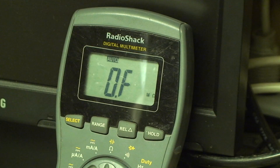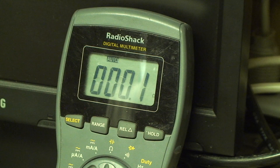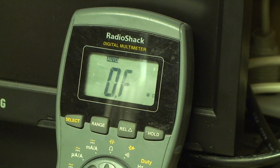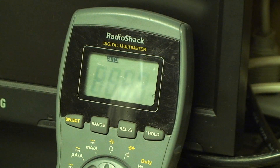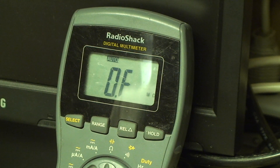There you can see the display of my multimeter. I'm going to stick the test leads on the diode, and in just a moment you'll see the multimeter update to show essentially zero ohms resistance — a very tiny bit of resistance. Now if I flip the diode around, it should gain a very high, if not infinite, resistance. But as you'll soon see, it does not do so. This diode is dead shorted. So basically any power supply attached to the router was being forced into a short circuit and either shut down by its overcurrent protection or hopefully blowing a fuse. In the case of a grossly overrated power supply, it might even blow tracks off the circuit board — something similarly disastrous.